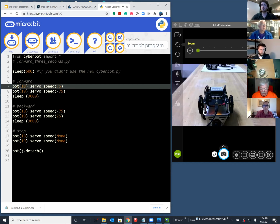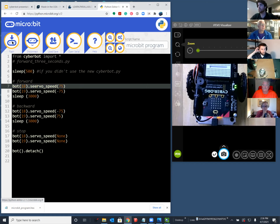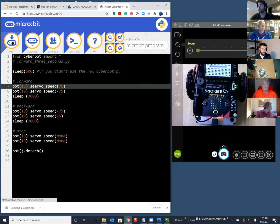You might have a syntax error, so check that. For example, if I change this line seven and misspell the word servo, and then I go to flash again, if I'm on the same line as you, I should see something like this. I see an unhappy face. If you're standing on your head, that is an unhappy face, and it says line seven. Did you see that on yours, Mark?